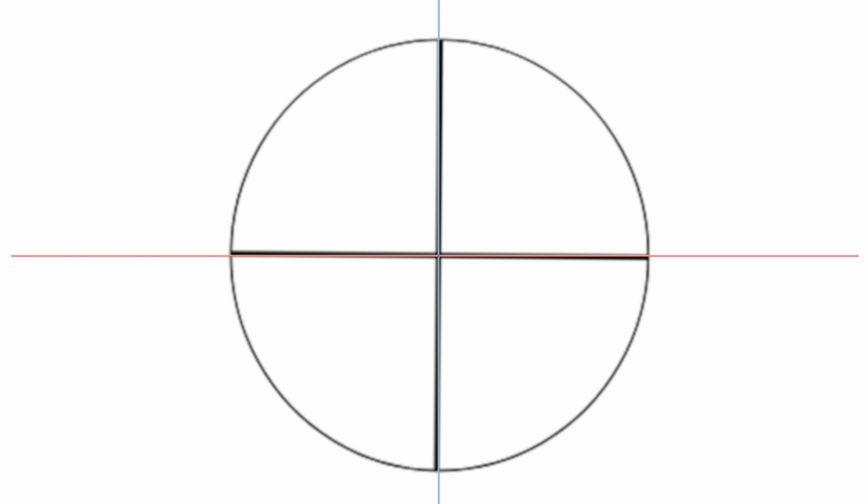The reality is your average scope has somewhere between 1 to 3 degrees of cant between the reticle and the body of the scope. If you get a chance, do a little research. Look on Google and see what you can find. Better yet, put a level on the body of your scope and then hang a plumb line and see it for yourself.